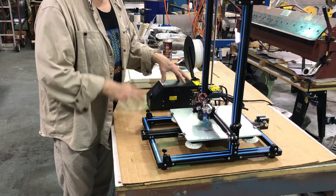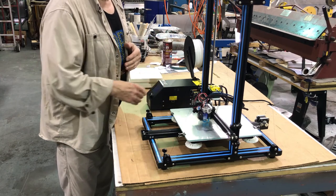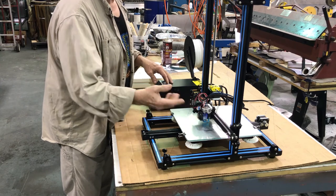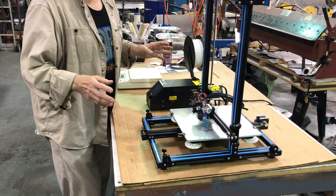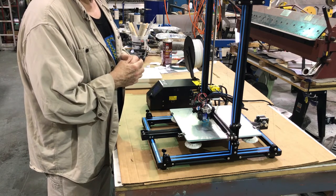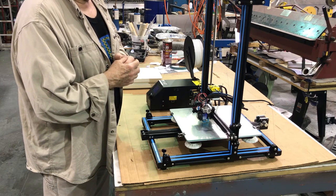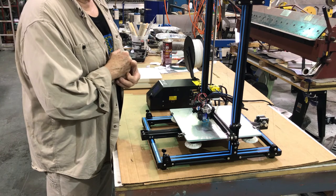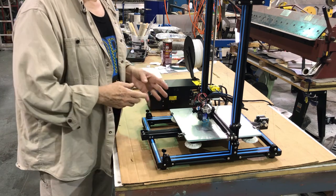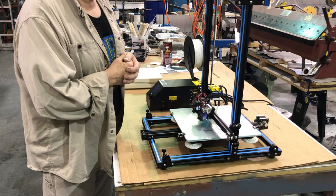That's all I'll say about that for now — we'll go into detail later. The CR-10 is a great little machine that operates within its parameters just perfectly. There are some neat gadgets available — these big fang fans and other things can actually cool the heater block too much on a stock CR-10 and cause it to shut off on low heat. You don't need all that. There are some specific great things you can do without overcompensating. Dollar for dollar I think it's the best machine on the market at this entry level — you won't find one in that price range that you can do this much with.